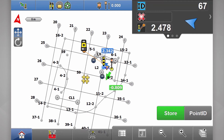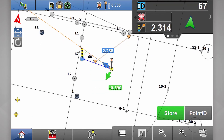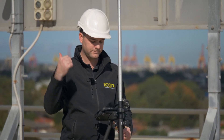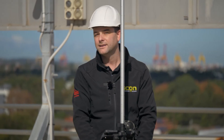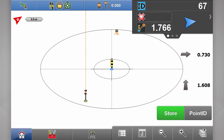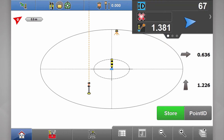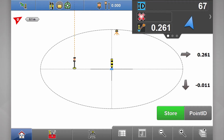So now I'll zoom in and follow my guidance. I know I need to travel two meters that way and 200 mil back that way. You'll also see once I start to get a little bit closer, a bull's eye opens up. When this happens, stop, turn and face the total station and follow the instructions. This is because the total station is set to the top of the screen by default. So I know I need to go 1.2 meters and 600 mil.